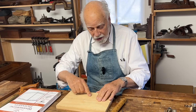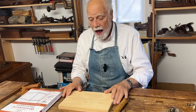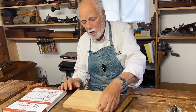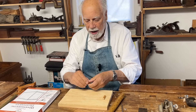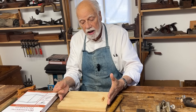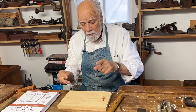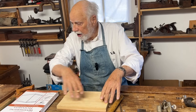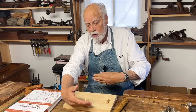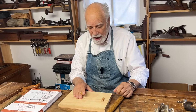I like the triangle mark, but you can write A and B or whatever you want. The next thing to do is to insert dowels — little dowels like this, every six or eight inches or so, the entire length of the board. I'm just using two short pieces here to demonstrate the doweling process, but remember this technique is particularly good if you have a really long surface and you want to make sure they not only come together but come together perfectly flat. That's what the dowels do.